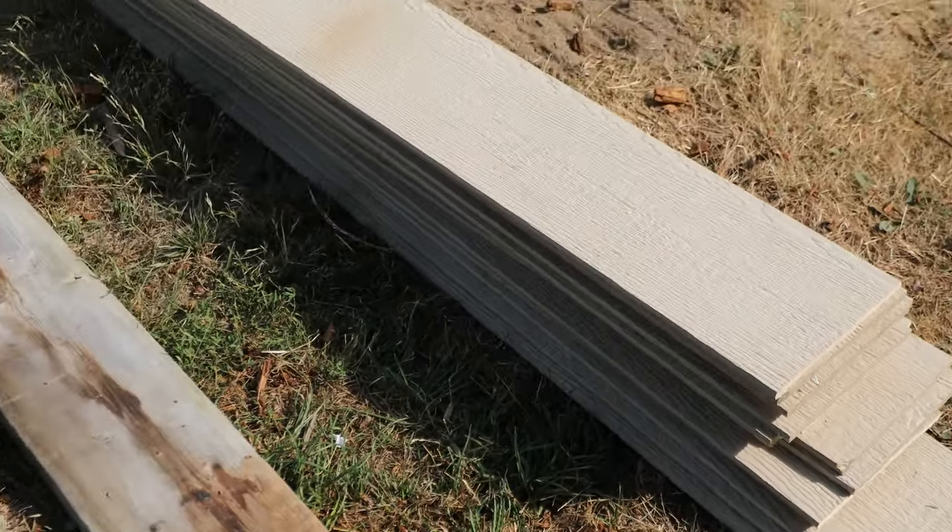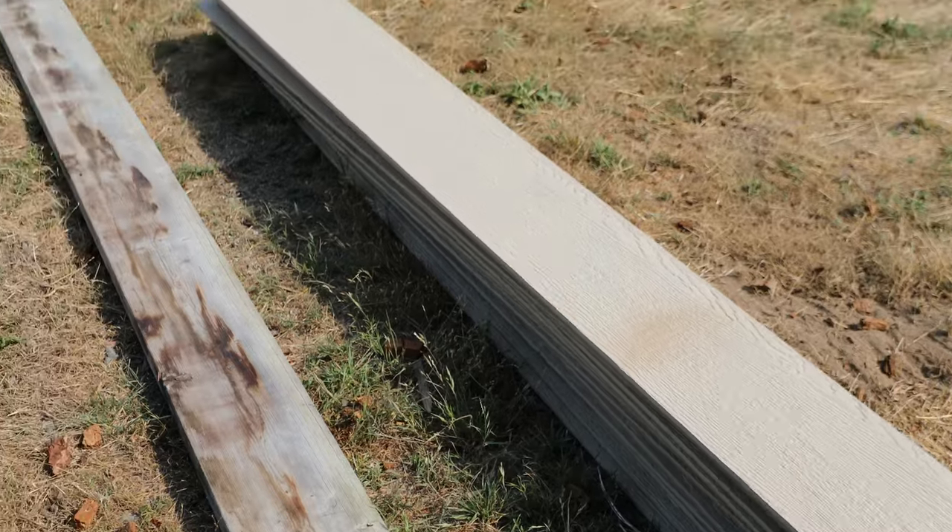I have my fascia material. I'm going with some pretty straightforward siding pieces from Home Depot that I had them cut in half so I didn't have to take home 16-foot lengths, so our door is going to be 8 feet tall. I chose that material because it's the cheapest and most coverage for my dollar. These doors are really just to add a marginal level of security and air movement and control to this base — they're not supposed to be bulletproof or outrageously robust because this is a temporary structure. That's the fascia, and then I have some salvage lumber from the rest of the property that we're going to rip and use as our cross pieces to go with that rustic barn door look.